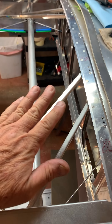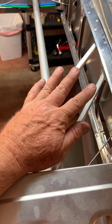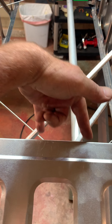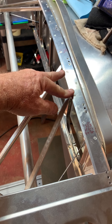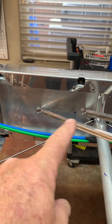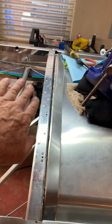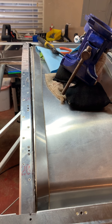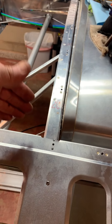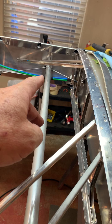One of the things you want to do — these are the braces right here that we put in. If you follow my forum post, I talk about not putting these ends on yet. You can install these sides and tighten them up with the nuts and small screws on this side, but don't do those yet because we have to flex this rib and the number one rib just a little bit to get the tanks in, since they're going in at an angle. This lets you actually move the ribs out of the way as you push the tanks in. So with the small wire pulled back completely out of the way, the big wire is just kind of back out of the way a little bit.